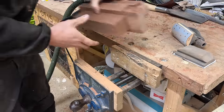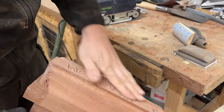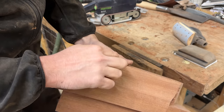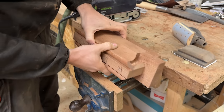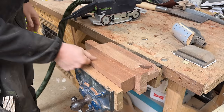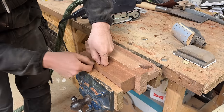Is to take you through that sanding process. What I'm going to be concentrating on is not the face or the back face, it's all these edges. So the rebates, the inside edge, all the molding, and the same on the other side when they're double sided. Nothing that is seen when it's painted and finished will remain unsanded, even the rebates, because that always looks bad. You see like 7 or 8 mil of that rebate.